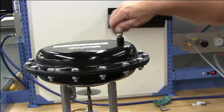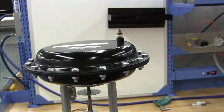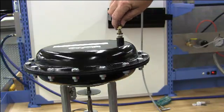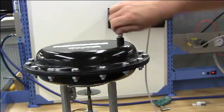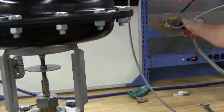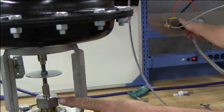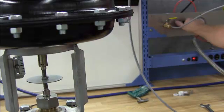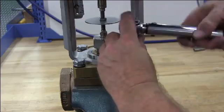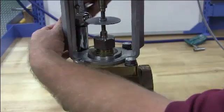Screw the air fitting into the top port of the actuator and connect the airline into your fitting. Never exceed 45 psi to the actuator, otherwise internal damage can occur. Give it air pressure until the plug hits the seat. You will see the plug moving down. It should stop moving when you get to 15 psi. Now that the plug is touching the seat, tighten the four bonnet bolts.